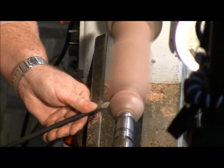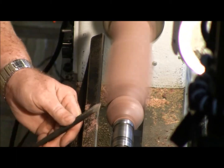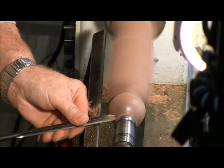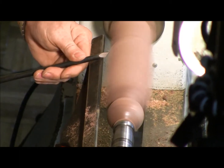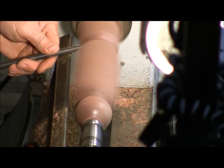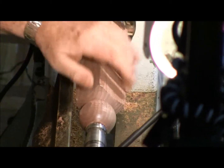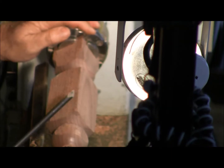I like to use a chop saw with my turning a lot, especially for production turning. I got a couple things on my shoulder so I prefer to take the piece to the chop saw and cut the end off rather than trying to force it around. Just keep eating away at it until you see some room to make it round. These edges chipped off a little right here, but this is going to go against the disc sander when I get back in my shop. I do need to make this a little more round — but that would be fine.